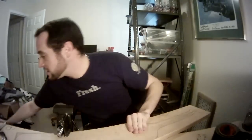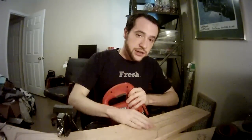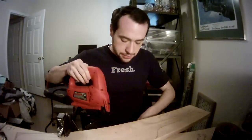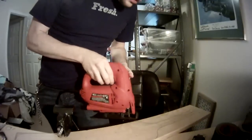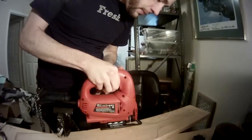Well, with that being said, I think it's time to get started. Once you've got your pattern out on your board — again, creativity is the limit — go ahead and clamp your piece down to your workstation and we're going to begin cutting. My vise is too small to really hold this board effectively so I'm just going to use it more as a clamp today. The main thing to think about when doing precise intricate cutting work like this is to always curve away from the wood. If you feel like you're going to mess up, curve away from your pattern — you can always take away more wood later but you can never add it back once it's gone.